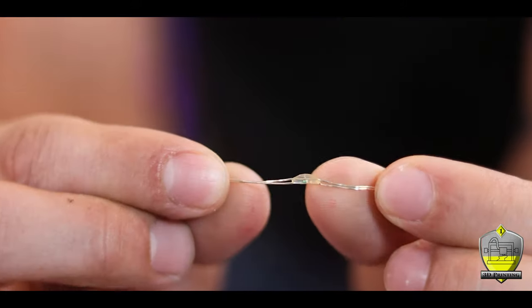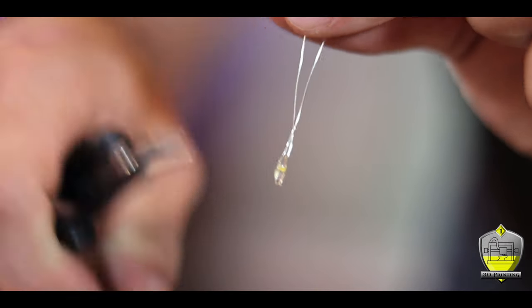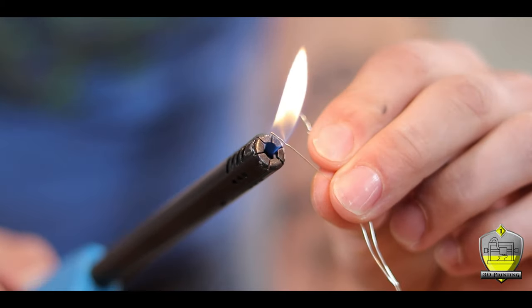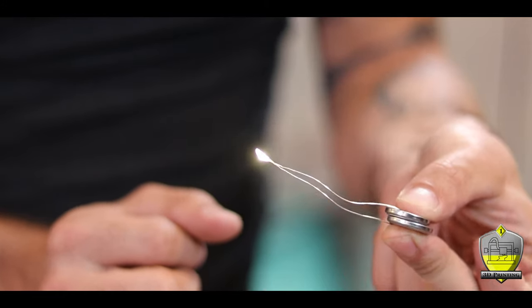The cool thing with these fairy lights is to get individual LEDs off of them, all you have to do is cut them really close to the top of the bulb. Then using a lighter, you can melt off the protective coating at the very ends of the legs. Once you connect them to the battery, they light right up. So you basically have a string of like 50 individual LEDs you can get for a pretty cheap price. And the legs are also coated wherever you didn't melt it off, so if they accidentally touch each other you're not going to get a short and shut your light off.